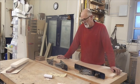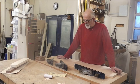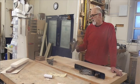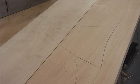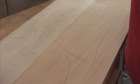That's basically the story. If you were thinking of buying a plane, and you've only got one, I'd recommend a 5.5. That's the sort of workhorse plane. A 5.5 as opposed to a 5, because it's got more weight to it, and a lot of planing is about momentum. For this exercise, we'll just joint two boards together.